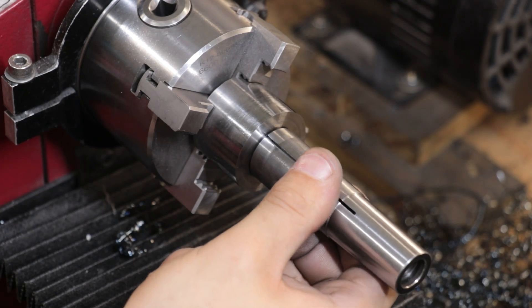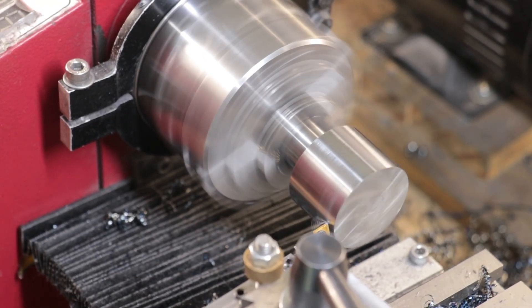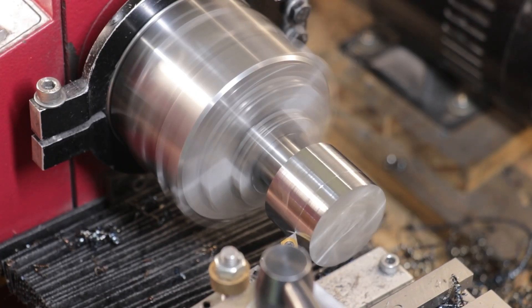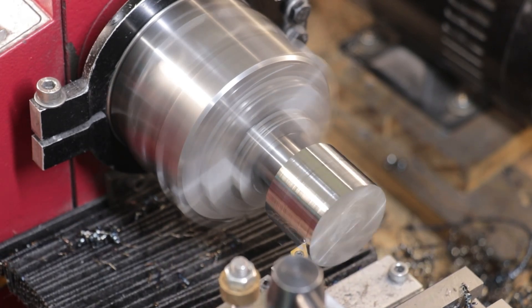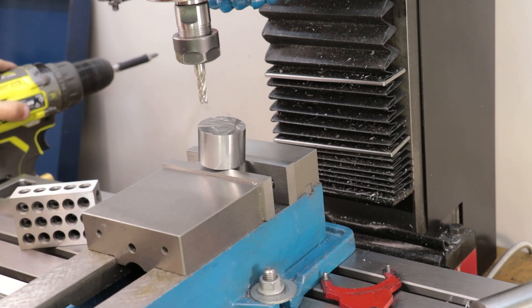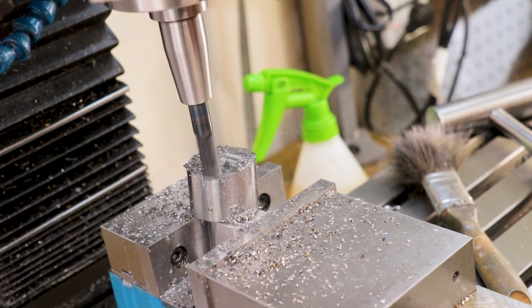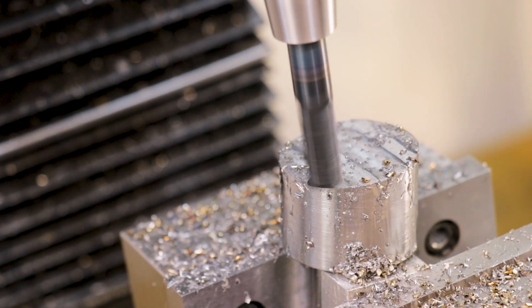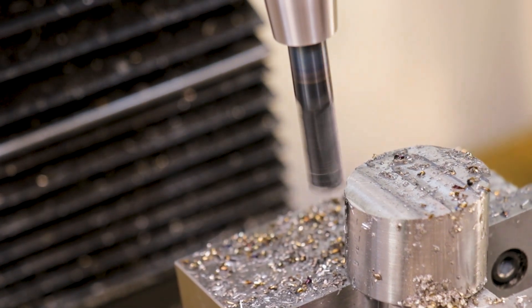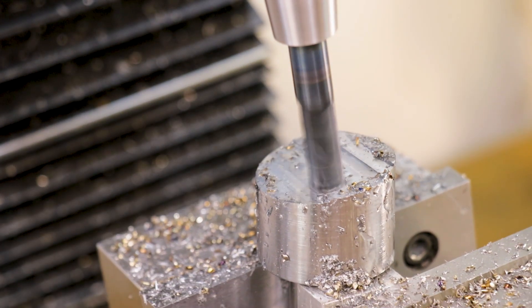And that is an almost perfect fit. I'll now set it up in the milling machine to cut the bottom face, which I'll do at an angle. Now the angle that you choose is really going to depend on the insert and the tool holder that you're going to use. But in my experience, having made four of these in the past, fly cutters can be very forgiving with regards to the overall angle and geometry. From what I've seen with other people's fly cutters, 10 degrees is a pretty common angle, but I'm going with eight. Eight should help balance the fly cutter, although it's never been a huge problem with smaller fly cutters.